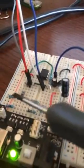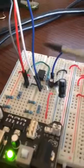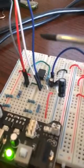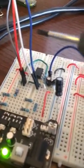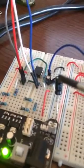You can see here's a thermistor circuit. Basically, the resistance will change as the temperature of the thermistor changes. That is fed by the white and the gray wire. The thermopile circuit basically is a bunch of serial connected thermocouples. So as it sees the radiant heat waves, this blue and gray wire produce a voltage differential.